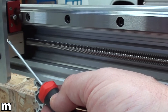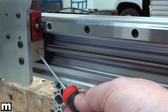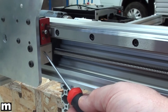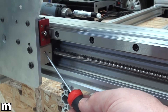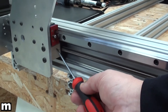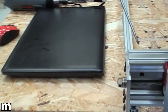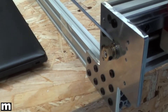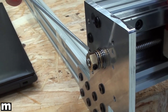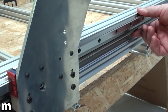In order to make the system fit from the plate into the block we had to make some spacers. They have to be very precise in dimension, and for the prototype we have made them in plywood. However, the plan is to make them in nylon or alternatively aluminum for the final production version. At the end on the outside we again have a stack with a flanged bearing, a thrust bearing, and then a lock nut that can tighten up the acme lead screw so wobbling is reduced.